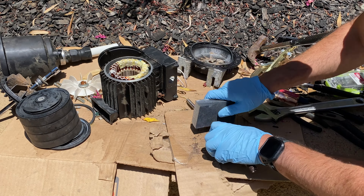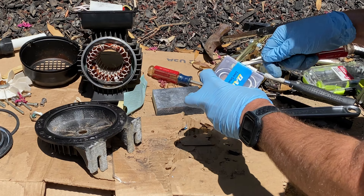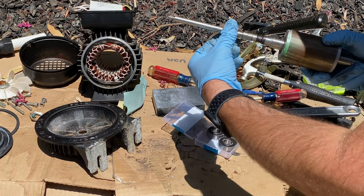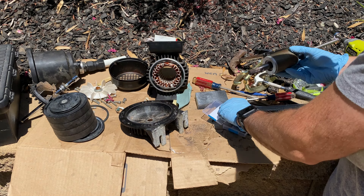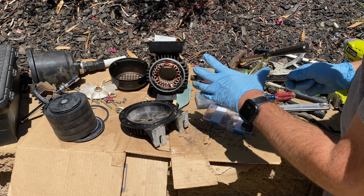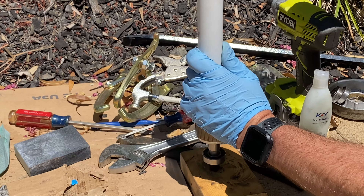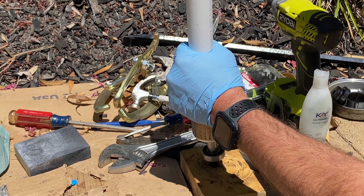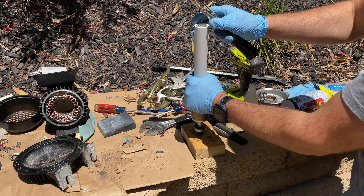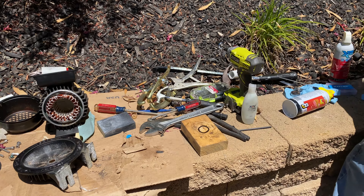When the bearing is off, clean up the shaft where the new bearing will be slid back into place. I'll put a link in the description for the exact bearings for this model. There are numbers on the side of the bearing — if you don't know, pull the bearing off, look at the number, and order accordingly. You won't find these bearings in a spare parts manual for Pentair or Polaris pumps because the motors are made by a different company, so you'll need the model number off the bearing to order a replacement. Tap the new bearings back onto the shaft using a plastic PVC pipe so you don't bend or hurt anything, and use a block of wood on the bottom to protect the shaft. Take your time, go left and right over and over, then clean it off with some brake fluid cleaner since that's going to be inside your electrical engine.